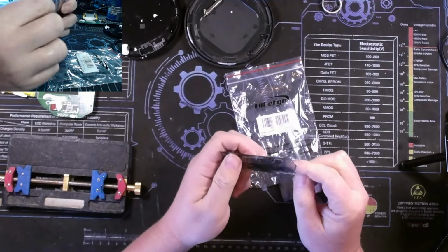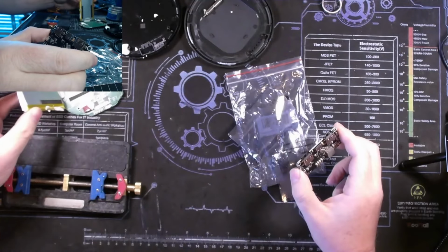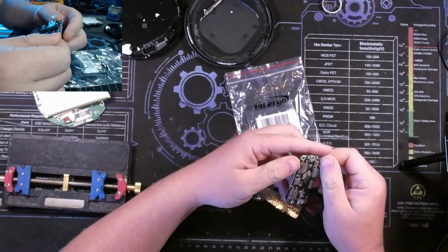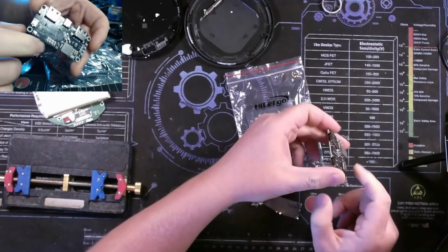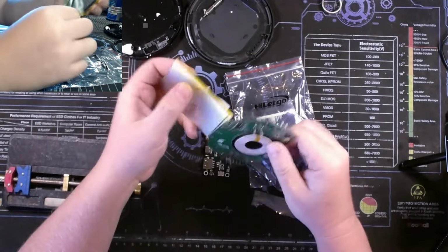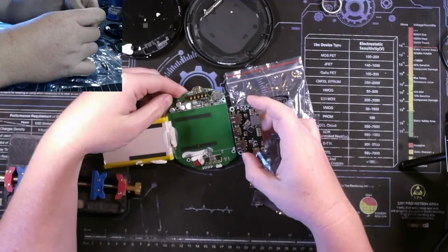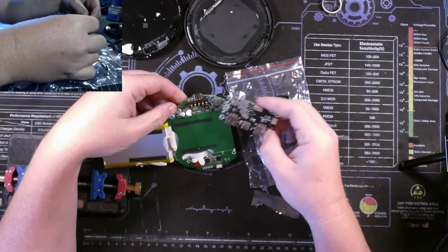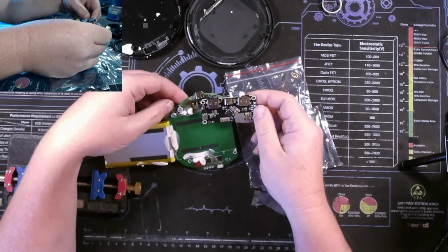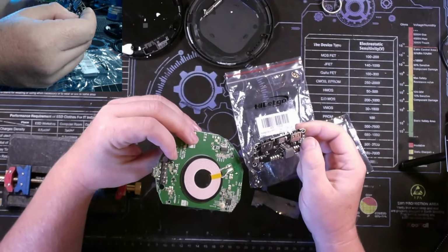And they're designed for charging a lithium battery, and a battery like this guy over here via USB-C, but they have the same PMIC as what's on this guy right here that we removed from that pad. Not all the topology is exactly the same, so basically it's kind of like the upper side of the board is all here, the bottom side being most likely for this wireless charger.